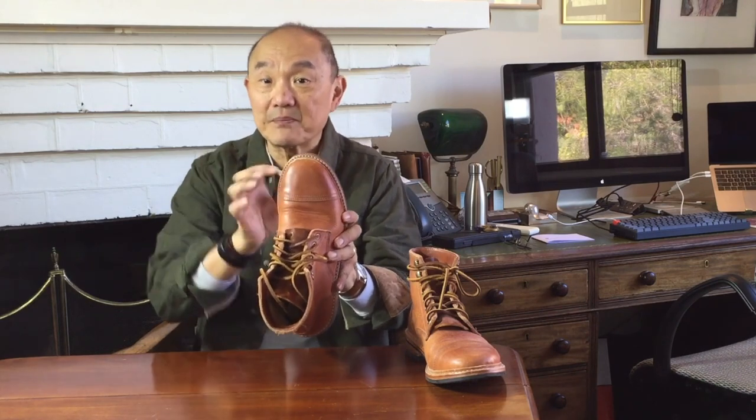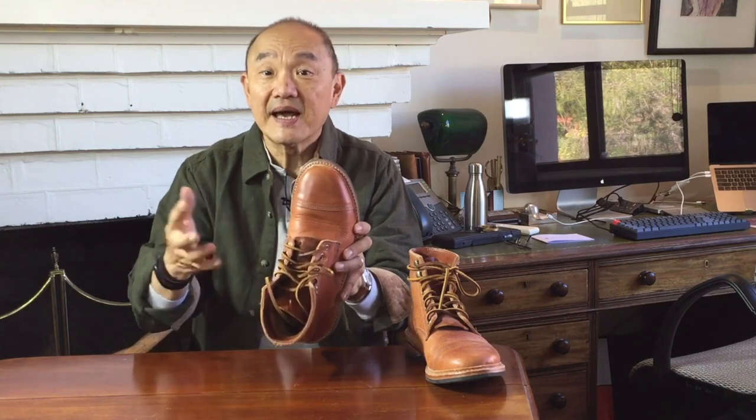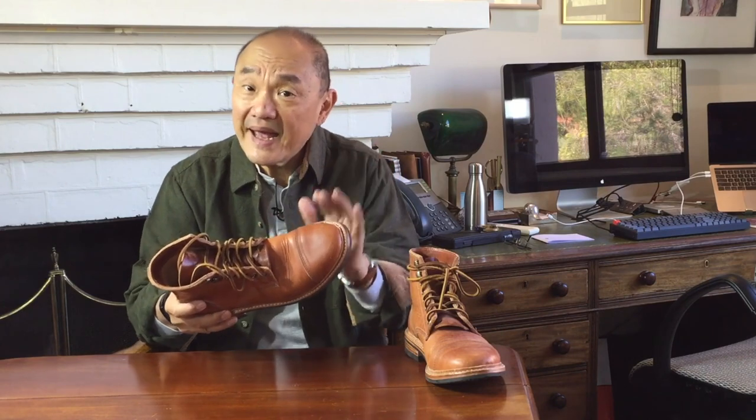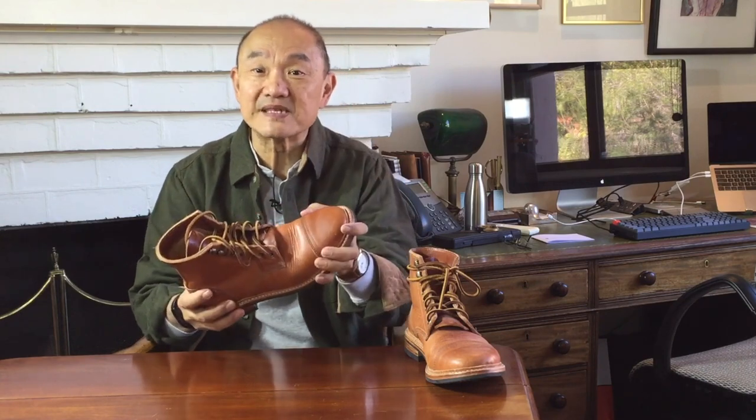When you use a machine to last, you set a pressure and the mechanical fingers come out and grab the uppers and push them down against the last in a uniform pressure, and it doesn't give if the leather reacts differently. In hand lasting, a person's fingers, with a sense of touch, are pulling the leather, and the brain somehow compensates as the leather stretches and feels different. And ultimately, a person's hand may get tired at the end of the day.